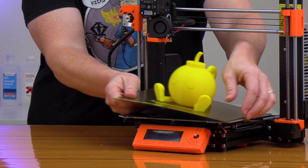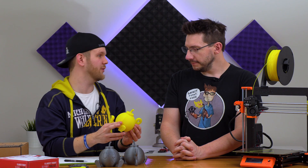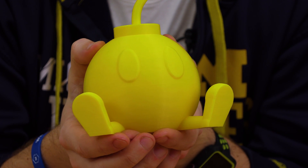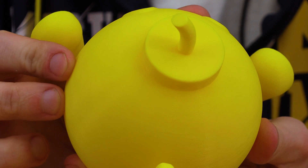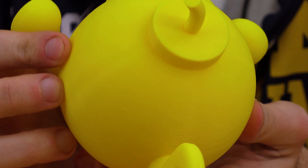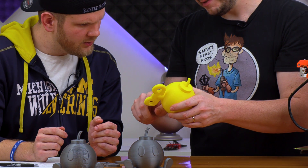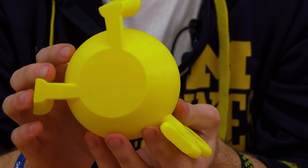And here's the result right here on the print bed — it just popped right up. Beautiful! The Bob-omb hair looks fantastic — smooth finish all the way. No zits, no warping, no surface scratching. You can see on this model where the earlier layer shifts occurred, because as the belt travels with a loose pulley it won't be in the same spot. Now it's consistent all the way through. We've got a really good Bob-omb thanks to troubleshooting.